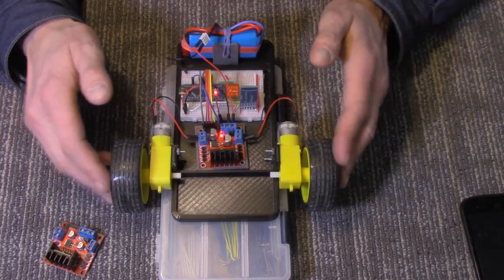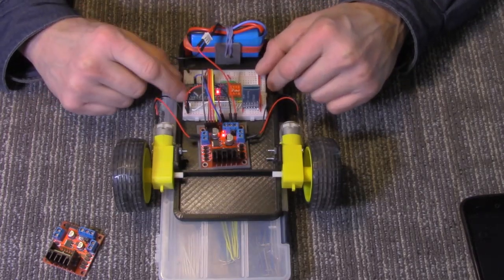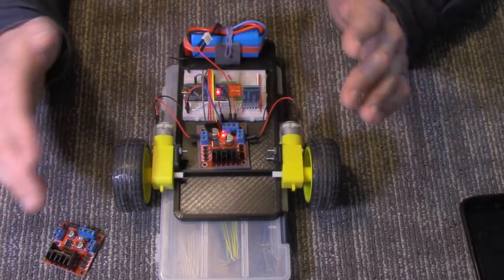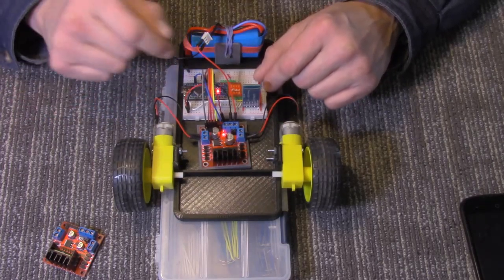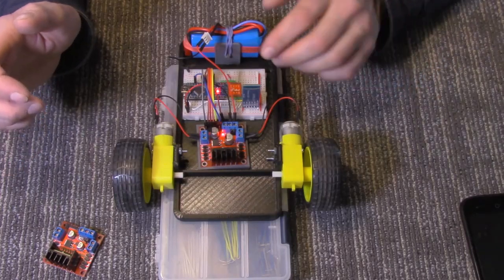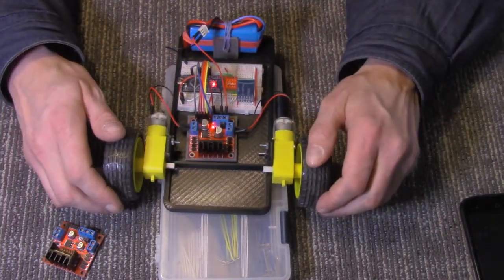The whole schematic circuit of how to hook this up — once again, look in the description below and click the link to this project's webpage. You'll find the schematic diagram there. I'm using an Arduino Nano. You can use a Pro Mini, but I would not recommend trying to use a Uno — you're just not going to have room. I went with the Nano because I'm programming it frequently and didn't want to deal with the extra wiring the Pro Mini requires. I still have room for a few more connections, and if needed I could add a smaller breadboard.